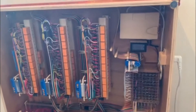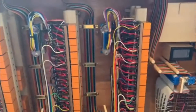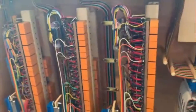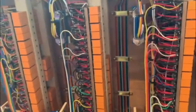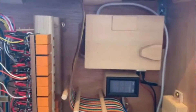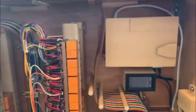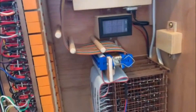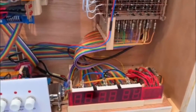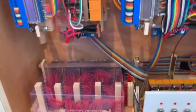The method of construction I've chosen is to have all the wiring, relays, diodes and all the components visible and on show. Here are the three ring counters — the seconds, minutes and hours. And in the top right corner is a pulse generator fed from the mains cable, so it's always in sync with the time. Then there's a diode matrix which feeds the time display and the control panel.